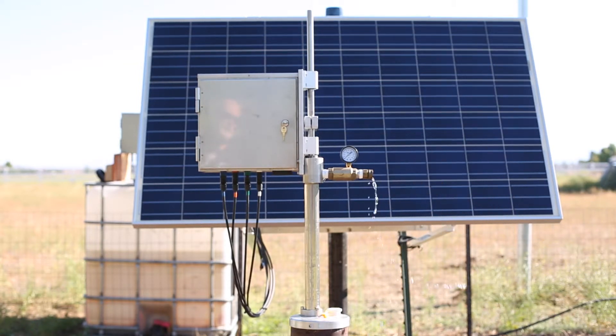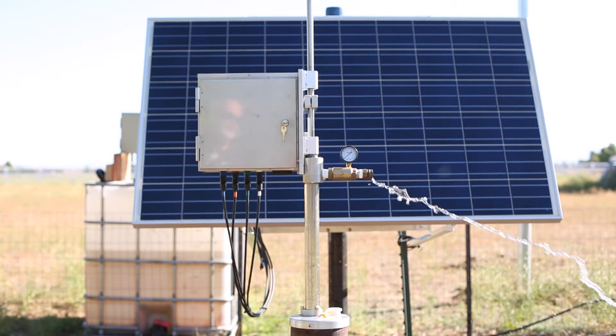The pump is operating at 60 RPM, and the gallonage of output is approximately 2.5 gallons a minute. We have a model 125 cylinder at the bottom of the string of pipe. The water level in this particular well is about 60 feet down. And with this kind of sun efficiency in northern Nevada, this would deliver about 130 gallons an hour.